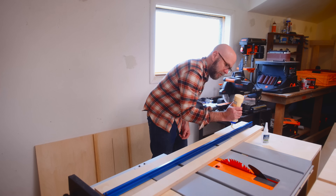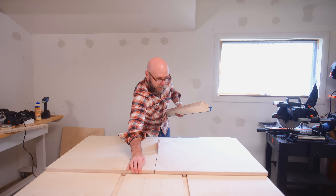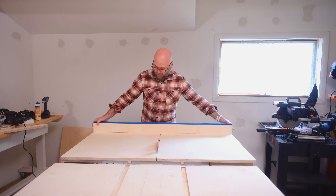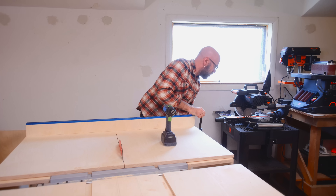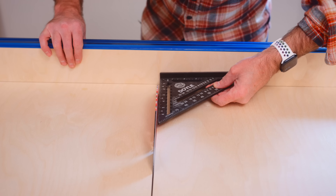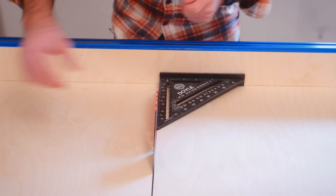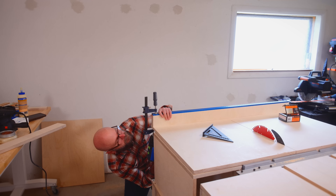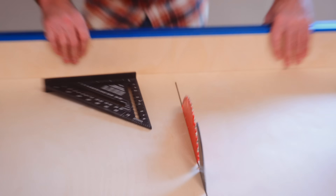Glue on the back part of the fence to make it nice and thick. I've gone ahead and created a kerf in there, not going all the way to the back. I'm going to set the fence on here and put one screw in on this side so I can pivot it to get it squared up. In the past I've done the overkill five-cut method, but just using a square to the blade has worked great for me for years. I don't think we can get any better than that, so I'll run a few more screws in.